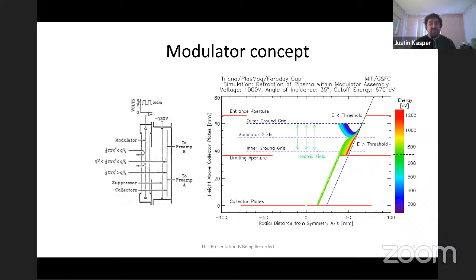If I have a solar flare producing ionizing radiation generating weird currents within the collector plates, or UV hitting the collector plates releasing electrons through the photoelectric effect, or thermionic emission - pick whatever noise source you want - unless that noise source has a component varying at our modulation frequency, we don't pick it up. The Faraday Cup with synchronous measurement is intrinsically insensitive to ionizing radiation, UV radiation, and mechanical noise. This is one reason Faraday Cups are really good for operating in intense environments, even in the midst of a major solar energetic particle event or passing through the radiation belts.